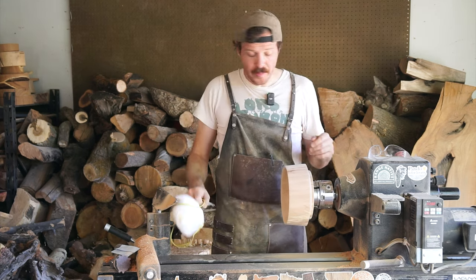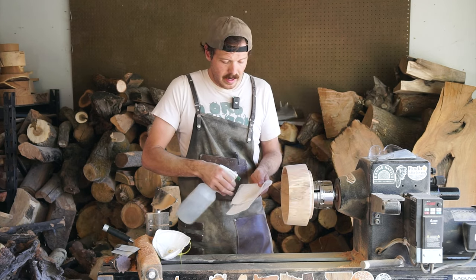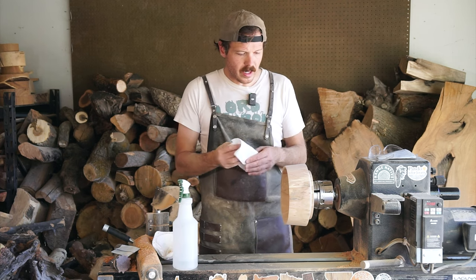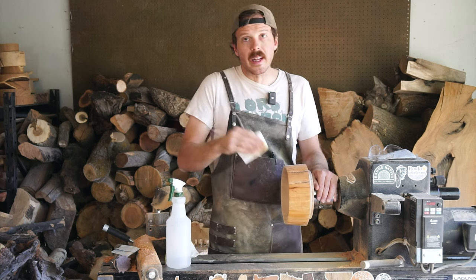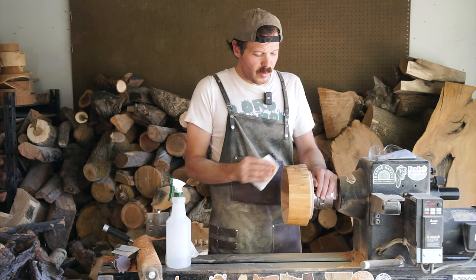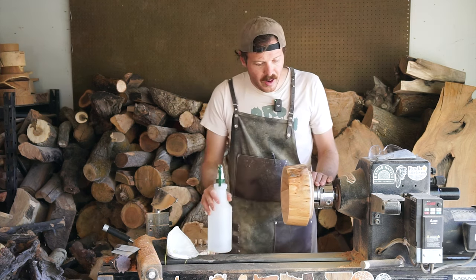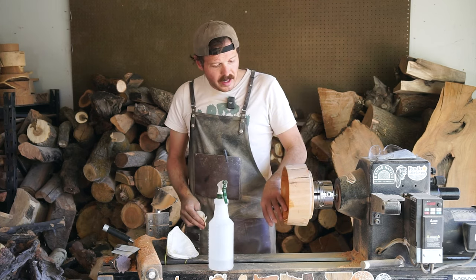Okay, let me turn this off so I can talk to you. Sanded down to 220 grit — get the wood fibers nice and wet, and what that does is raise the grain of the wood, especially wood that's nice and soft like willow. Once it dries off, we can then sand it again and knock down that raised grain. It's going to make the whole thing feel nicer overall. The other real bonus to this is you get a little bit of a sneak preview of how cool this wood is going to look. Now we'll just wait for the inside to dry.